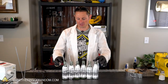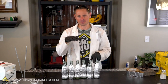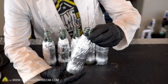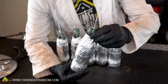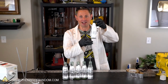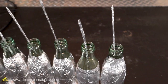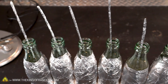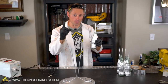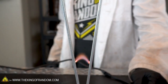I took all these glass bottles and turned them all into capacitors — they all look exactly the same, except on one the foil is a little bit lower, but that won't make a big difference. This is a basic capacitor: on the inside, the salt water acts as a capacitive plate; the glass is the dielectric; and on the outside, the aluminum foil acts as the other plate to help build up that electric charge.